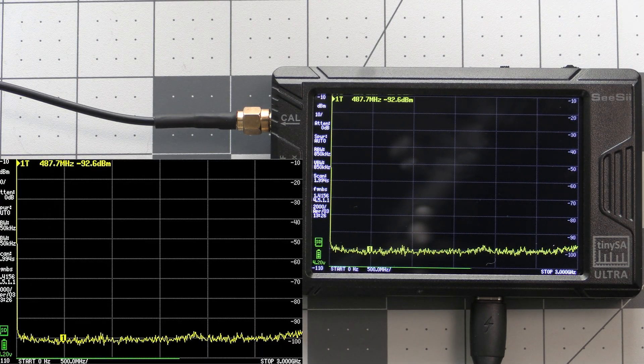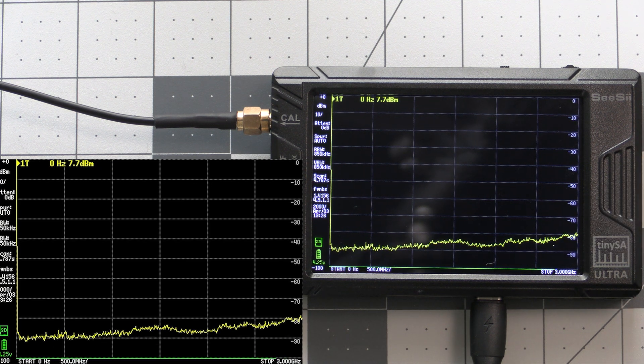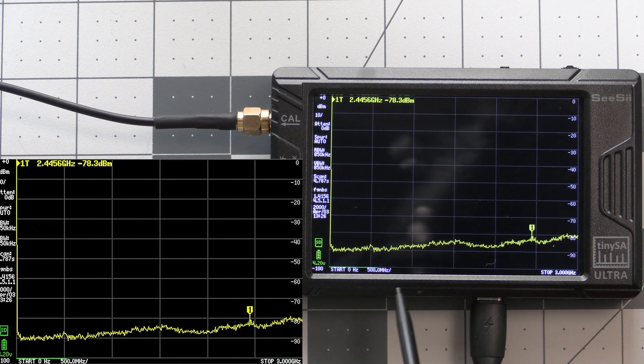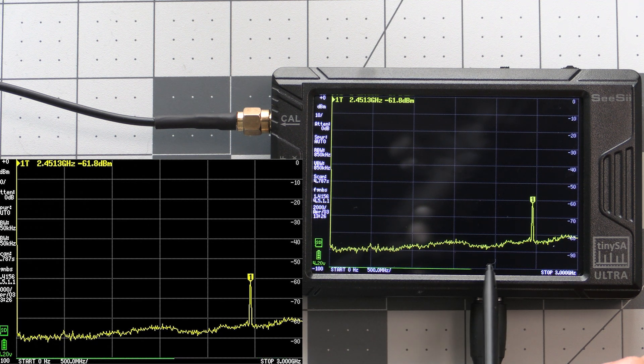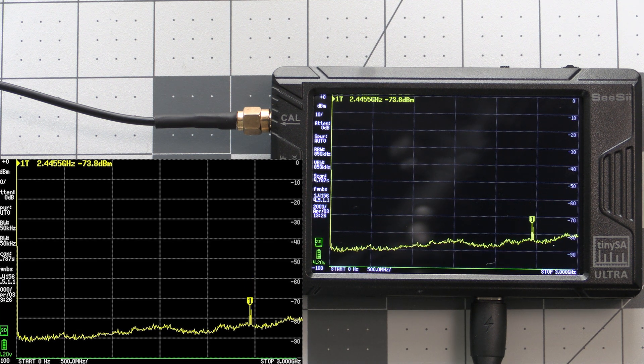Now if we look at the screen we can see that it's scanning up to 3GHz. There are some disadvantages to running such a large scan from 0Hz all the way up to 3GHz — namely the scan time is much longer, which means it's possible to miss signals that only transmit for a short period of time. This isn't a big deal since we're typically not going to run such a wide scan anyway. In the case of Meshtastic for example, we would only scan from 900 to 930MHz or so. Speaking of Meshtastic, we'll be going over how I used the TinySA to troubleshoot a range issue in the next video.